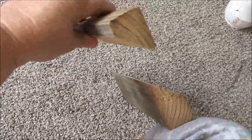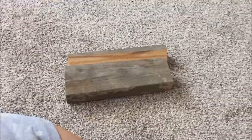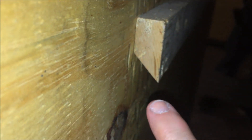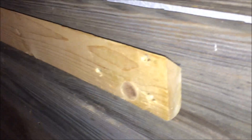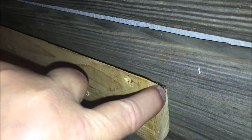This is the headboard and this is what's secured to the wall, and it just slips right in there and hangs. Now let me show you on the actual headboard. This board is screwed onto the headboard with the angle going in that direction — this is the back of the headboard. Then we screwed this board to the wall; we just decided how high we wanted to hang it, and this one is screwed to the wall with the angle going that way.